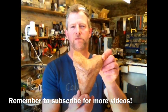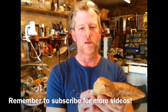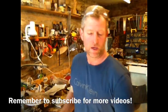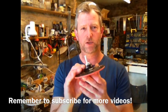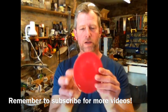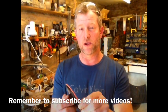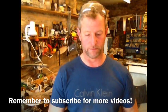Alright, that's how we're looking so far. Done pretty much all the shaping I'm going to do with the chisel. Now I'm going to do some sanding on it. So I'm going to use the drill press. I've got these little hook and loop attachments. Goes right into the drill press. Start with 80 grit, probably take it up to about 3000, get that really nice gleam and shine.